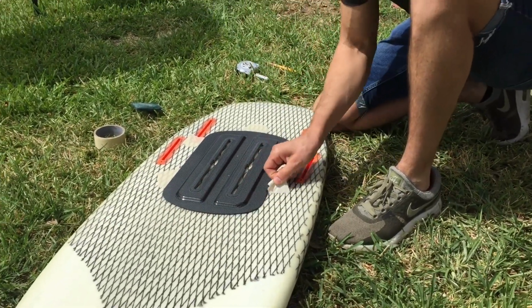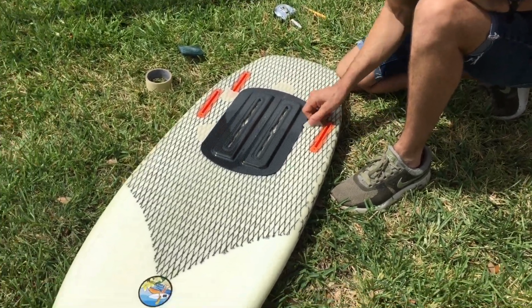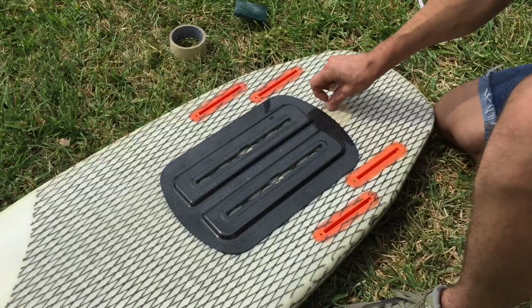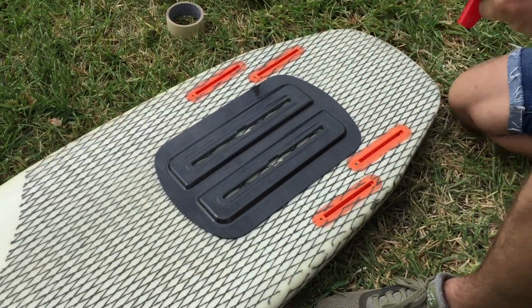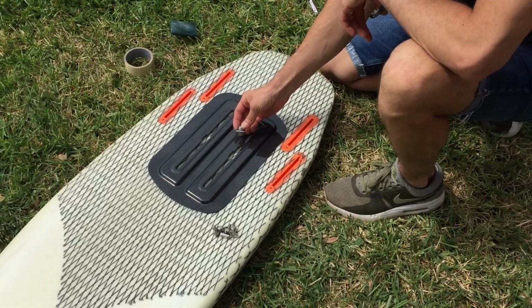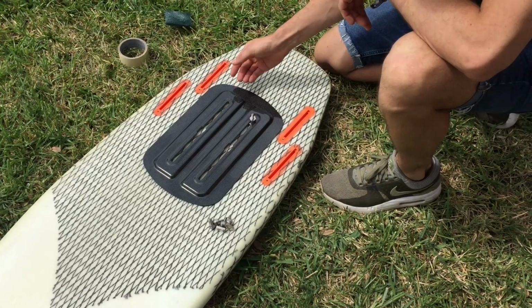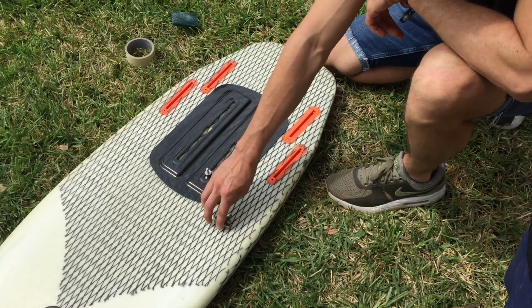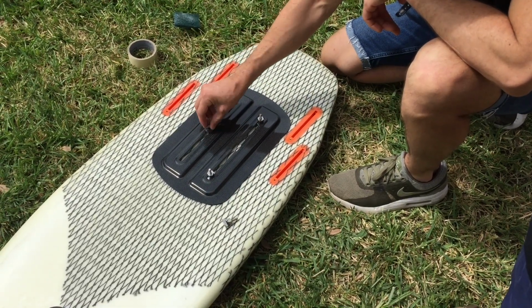So that's about it. Remove the Scotch tape and you're good to go. You're going to want to wait 12 to 24 hours to let that adhesive cure and get 100% bond. If it's colder, you're going to need longer on that curing, so it's best to install in more than room temperature, so 72 degrees Fahrenheit or higher.